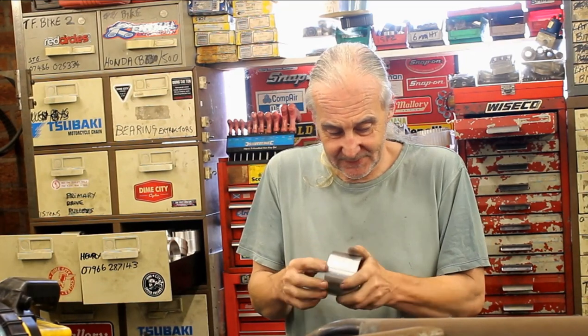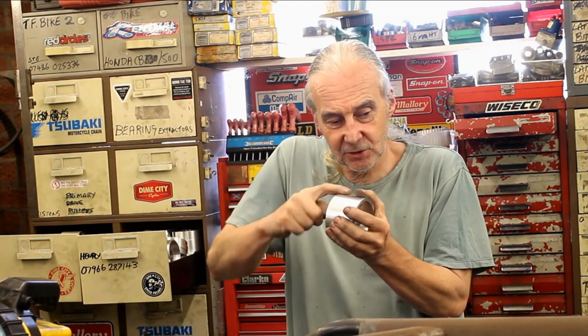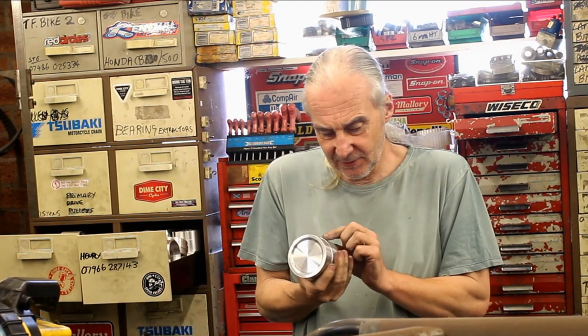Especially not with what they class as internal chuck jaws. But if you use external ones, with the bigger flange on them, when I come to mill them, you're not too bad, because they've got a bigger surface area. It's the smaller contact point chuck jaws that can leave marks. But even if you've got an odd little indentation, once they're polished and sorted, it's fine.